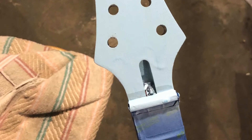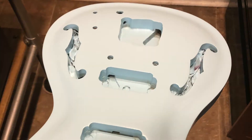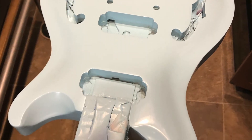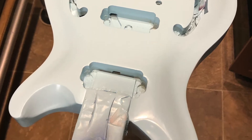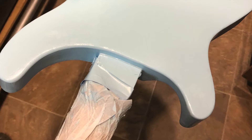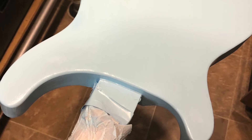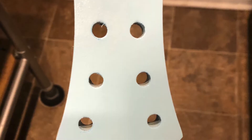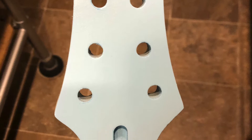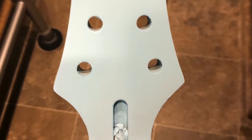Trying to make sure things are as good as I can get them. Probably would have done better if I had practiced, but here we are after I've sanded back some of the runs, some of the dots, and we're getting there. As you build up coats, it does even out and you can eventually fix most mistakes. After these shots, I went ahead and sprayed an entire can of the satin lacquer. It started blending in, but it did also help take off some of the sheen. We're going to transition to the neck next, just in case there's any errors, to make things easier to fix. I also found as I went to remove all of the tape that there were a couple of odd spots that we will have to sand back, so I'm glad I went through that process. Hopefully the next couple of coats or maybe even the entire can will fix that.